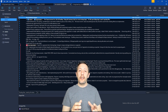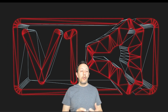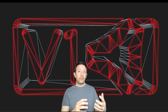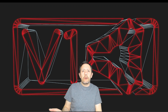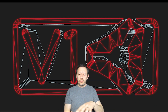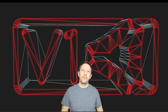After tinkering with, extending and speeding things up, I think my fork's ready for curious folks to try out. Within just a few minutes, you can load a 3D model STL file, position and tweak how you want the hologram to render before exporting an SVG image file that contains all the etched hologram details that your regular CNC laser engraving software will be able to understand and use to create the tool paths that will actually engrave your material. So with that context, let's make some etched holograms.